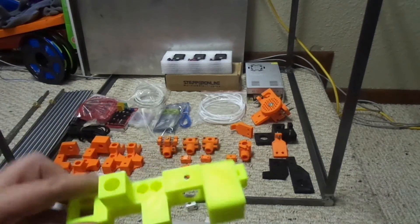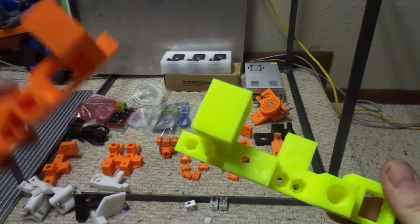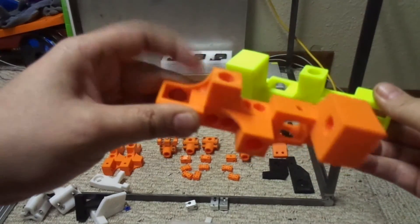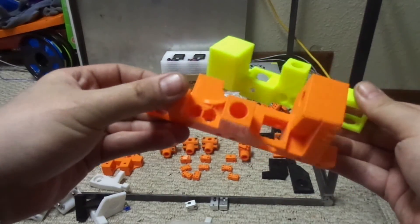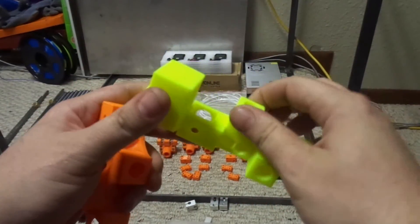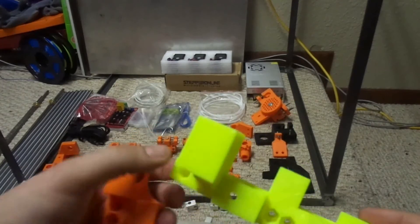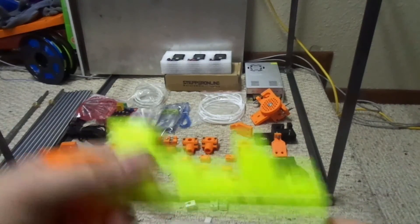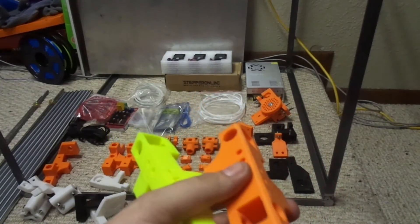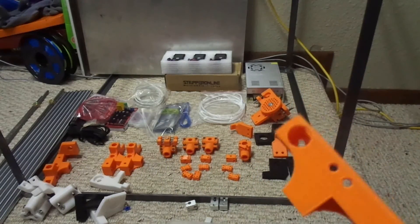I have a whole bunch of mockup things - these are ones that I printed first. You can see the difference here: I put these little edge things on there to make it more rigid. These ABS ones broke off really easily - I had one that just kind of snapped. The ABS is a little bit smaller because ABS shrinks. I use these for mockup to get the good spacing on the frame. I plan on posting all of my parts and pieces that I made on Thingiverse once I get everything made and I know that it's working for sure.